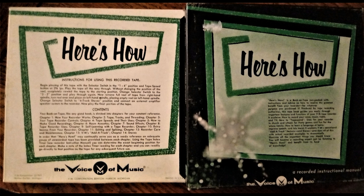And to think, I was going to ask Harry Downey to order me one of each! Well, Frank, what is the difference between tracks? A full-track tape is one which is recorded the entire width of the tape. The tape moves in one record-play direction only — you play the tape through the entire reel, and before it can be played again, you have to rewind it back to its original starting point. With dual-track or half-track — they both mean the same thing — the first recording is made on the top half of the tape, and to record the bottom half and double the recording time, you flip the reel over just like a phonograph record.